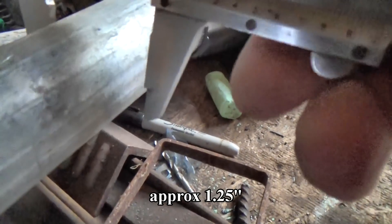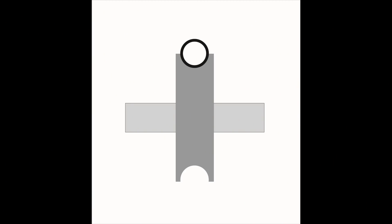This is 34 millimeter outside dimension thick-walled galvanized pipe from the local agricultural store — cheap and cheerful but tough stuff. To fit this pipe the cross-section of the wheels would look like a trough. What if I made up the wheel with lots of thin discs instead of one big lump? That way I wouldn't need a lathe — I could do it all on the plasma cutter. I played around and came up with a combination of six, four, three, and two millimeter thick discs, which gives a pretty good shape — at least in theory. That's still a lot of discs, and each one needs a hole for the axle and bolt holes too.